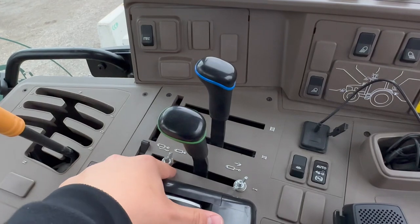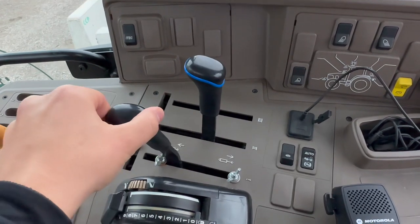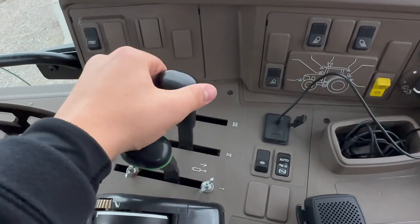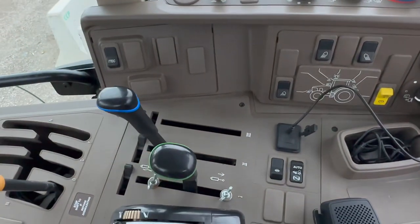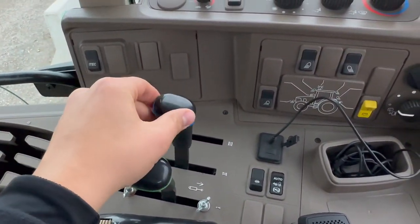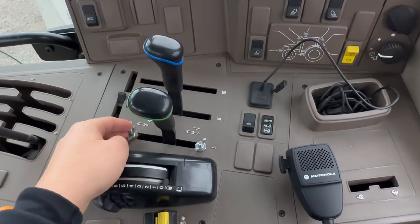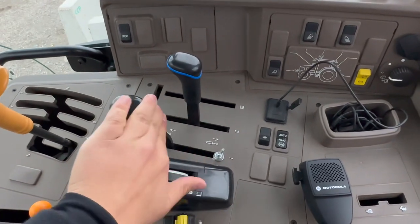And what we did is we bolted in a bolt with a washer and a wing nut here so that we wouldn't over-extend the movement of the chute. So what happens is, when I was using this machine last year, and this goes for all our machines with the manual levers in them, when you go like this and you apply too much pressure, it locks it. Okay, I'll show you what happens. Say for example, you're doing a driveway and you're moving the controls and you end up locking it. So it just did that with my hand off it, right? So we applied this little bolt-on system with a wing nut so that you can't have that ever happen. It doesn't lock. It could never lock.